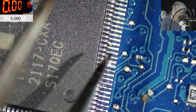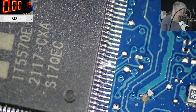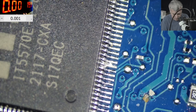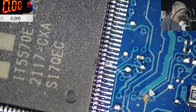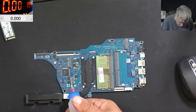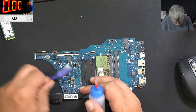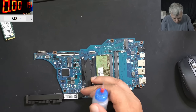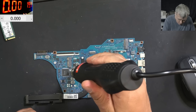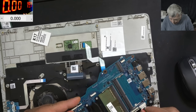So, because of that pin where I can clearly see liquid damage, that's the reason why this laptop is not working. Let's try alcohol — let's try to clean the whole area. Perfect. Let me dry it a little bit. Plug in the charging port.